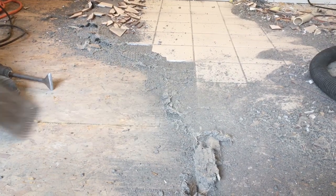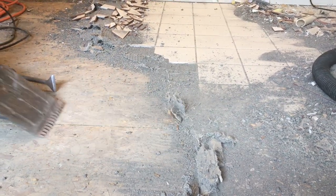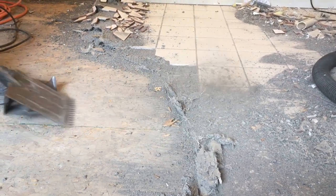So we had to bring in the big demolition hammers to get in between there. And those carry a lot of risks on their own — it's really easy to punch through your subfloor altogether, especially on floors like this, which is most of what you'll find in homes built in the last 30 or 40 years. This is just that particle board, that chipboard. This stuff is really easy to go through.